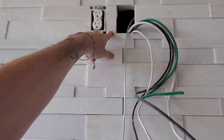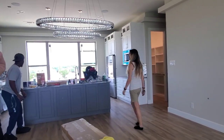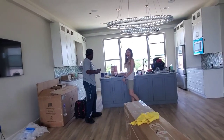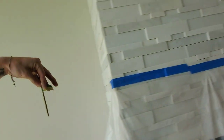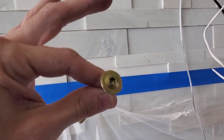We're using five-inch Spax lag bolts from Home Depot. On a standard TV we'd get three-inch, but we have a bigger wall here. These have a T30 bit head and act as washers — we use these for almost everything when mounting TVs.